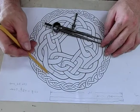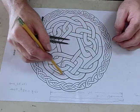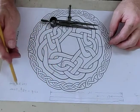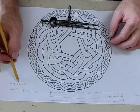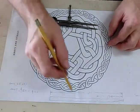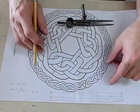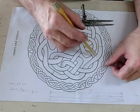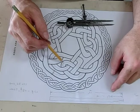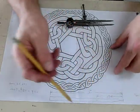So I'm going to add 3 inches more to the lengths on the ends here just to have extra stock and to help make these last bends easier instead of having to grab onto a short piece to make them. So adding the 3 inches onto the 28 1/4, that comes out to 34 1/4. We're going to round that down to 34 inches, which is what I've marked here, the overall length of our stock we're going to cut. And then I divided this off up to this bend here, was 15 spaces. So that's 7 1/2 plus 3 inches of extra stock makes us 10 1/2.